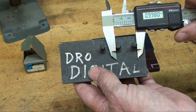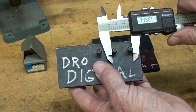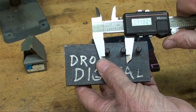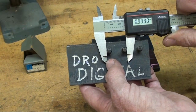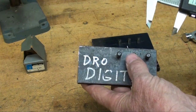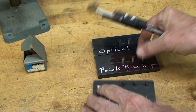This is the one I thought would be perfect, and it's not. We're about one and a half to two thousandths off on that one — that kind of surprises me a little bit. This one is off by about the same — approximately two thousandths off. I would have thought they would have been right on. I think the drills weren't perfectly sharp or something, because the actual location of the hole should have been perfect unless there's something wrong with my Accurite. That's a little disappointing.